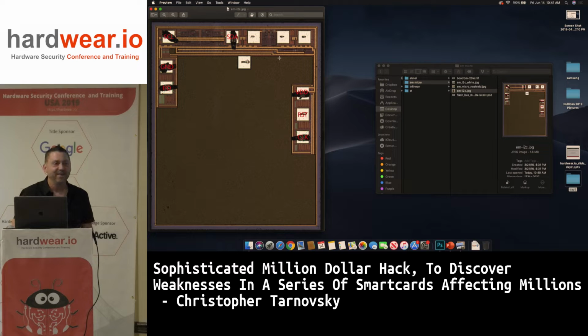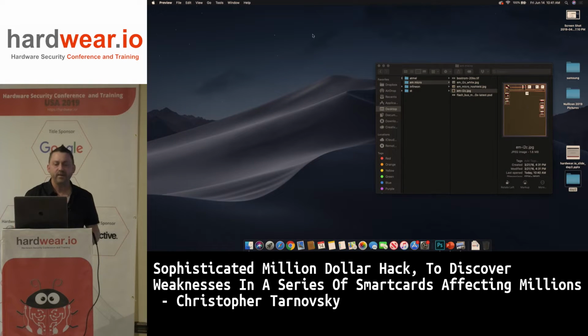This is like a 10-minute detour, and when you're on the FIB, honestly, the shield technology, you can bypass every shield I've ever seen with one FIB edit if you do your logic. Oliver and I were just talking about it yesterday, because at the end of the day, just like those alarms in the Samsung chip, it's one wire that turns on a 1 or a 0 that says, hey, there's an alarm going on in the chip. It's not 32 wires like you see on the surface, for example.